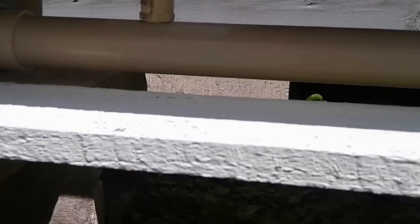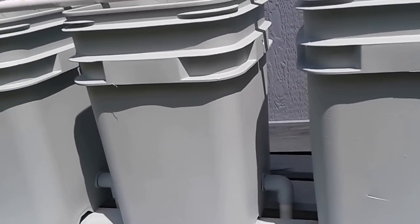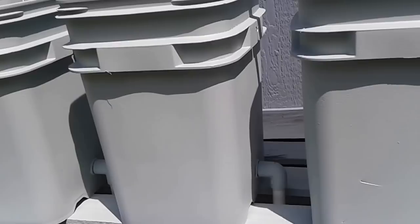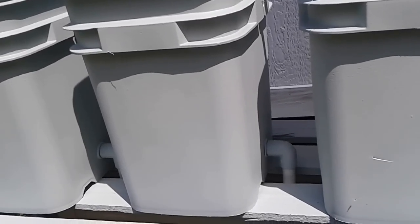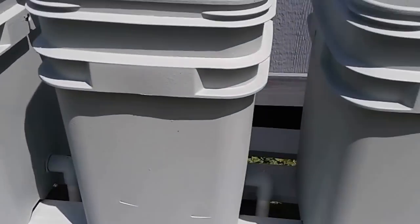For the bottom drain line, I spent a little extra to make sure it was a good watertight seal. I used an inch-and-a-half piece of PVC with a half-inch pipe thread male to a half-inch PVC coupling. Instead of threading it, I bought a half-inch steel pipe plug, hooked it to my drill with a socket, and drilled it into the half-inch pipe. That cut my threads so I could screw in my half-inch fittings and get a watertight seal.